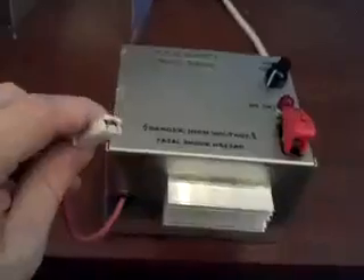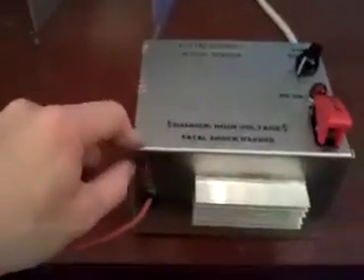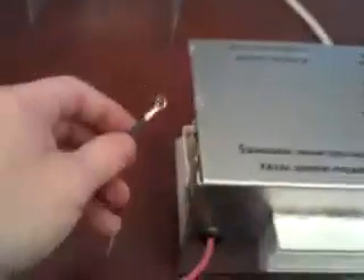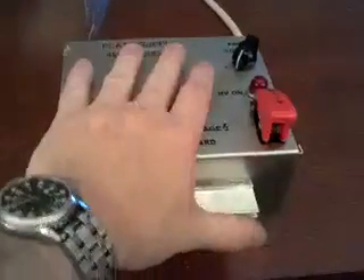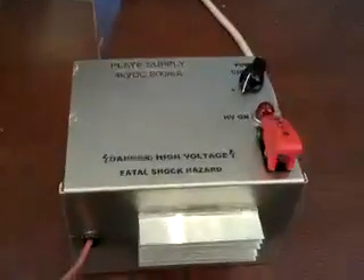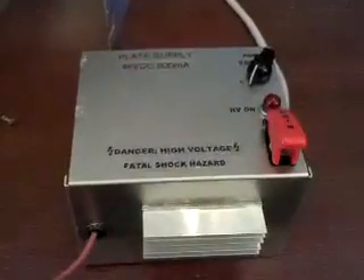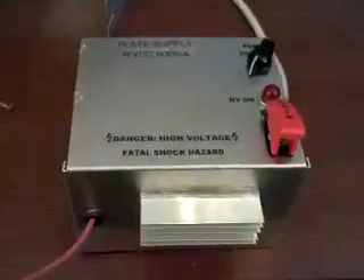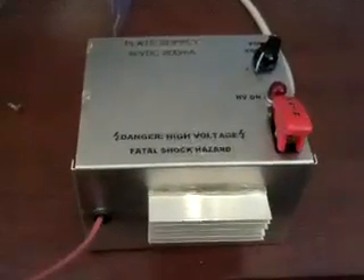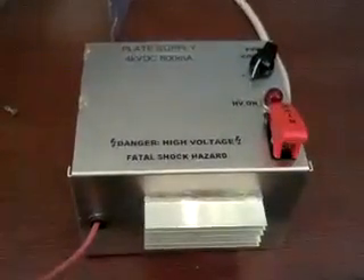I'll probably want a safer connector than this eventually, but whatever this goes into in my application will be completely enclosed and isolated, and that's where I'll provide the safety. The high voltage return is directly through the case, so when I reassemble it, I just have this grounded wire that goes onto the case screw right here, and that's where the high voltage return connects. So you now have all the information you need to use a Panasonic microwave inverter for whatever high voltage projects you feel a need to try out. Just be careful — treat this thing just like a distribution transformer or a heavy duty plate transformer from an old radio, because it is that powerful and that dangerous even though it fits in the palm of your hand. This is certainly the wave of the future, and it replaces almost every application that an old-fashioned microwave oven transformer would be used for. Have fun!